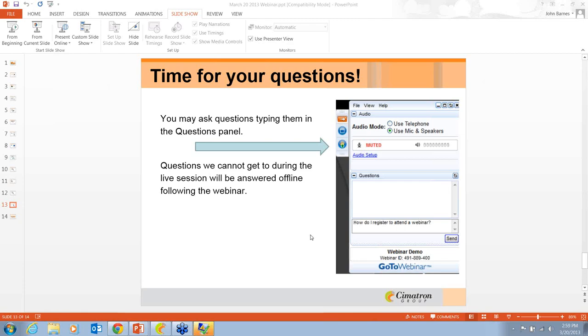Hey, Ken, somebody wants to know approximately how long it took to run that model of that cover. Do you have an estimate on the time? Yeah, for us to go from solid mesh until running the simulation and getting a full analysis, like filling, packing, cooling, and warpage, the total is about 2 hours using 6 cores. Wow, that's great.